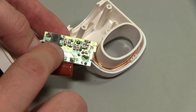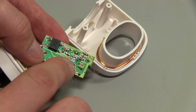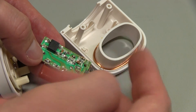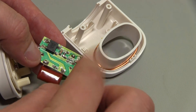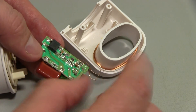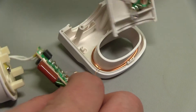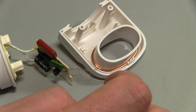On this side of the cradle PCB we've got an electrolytic capacitor, what looks like a fuse with heat shrink, and a big mains capacitor. Turning it over: there's a bridge rectifier giving DC output, smoothed by the electrolytic cap. The transistor circuit here must be pulsing that DC to generate the alternating magnetic field that's picked up by the torch's coil. It's probably a simple oscillator - resistors, capacitors, and the transistor opening and shutting - pulsing away so the torch's coil picks it up, rectifies it back to DC, and charges the battery.